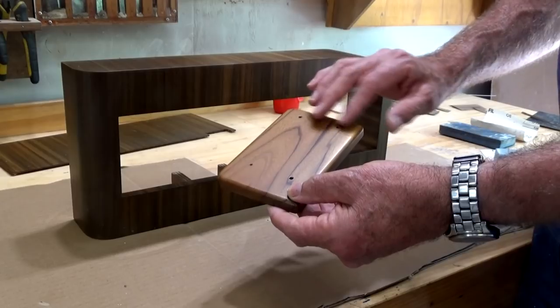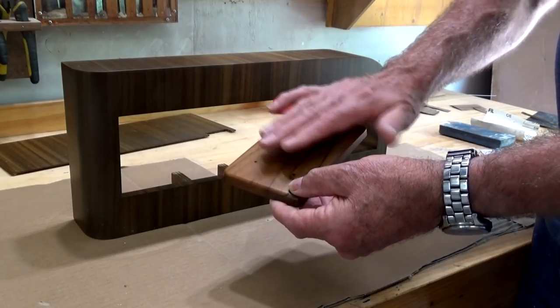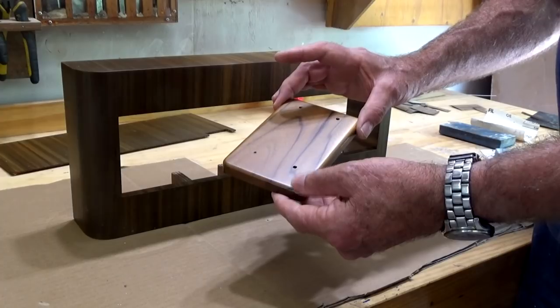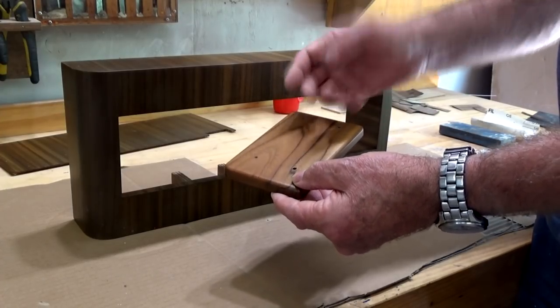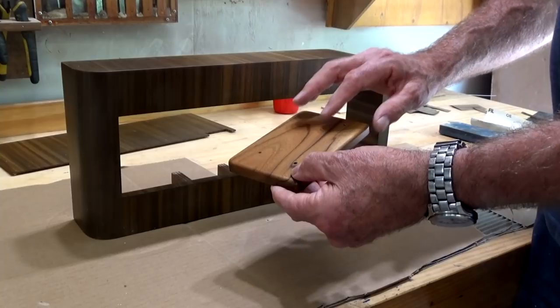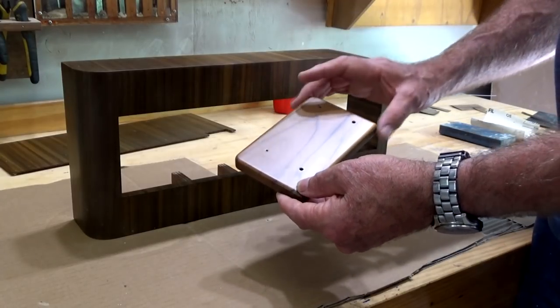The filler is like a powder, and it does two things. It does fill any remaining voids or cracks in the surface of the timber or open grain, and it also aids with the sanding process. So as you're sanding, it releases that powder, and it tends to not allow the grit to pick that waste material up. It sort of sheds that as you sand it.